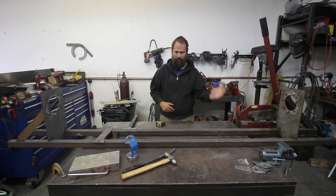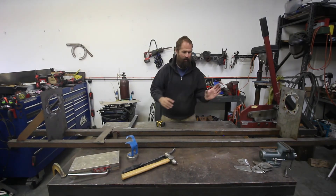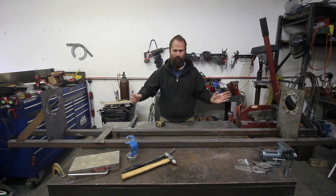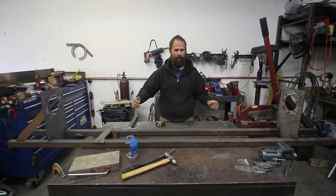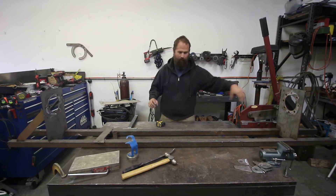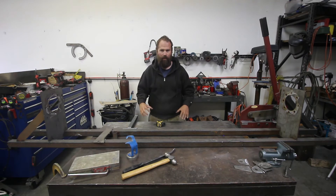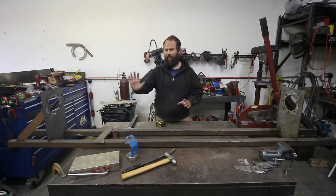I tacked the uniball cup on the front of the fixture so the uniball can sit right on it. I figured out from centerline where this pivot was and I wanted the beam to go straight to clear that diff beam's uniball, then kick it back with as little bend as possible. I ended up tucking this uniball cup as close to the front of the beam as possible — about a quarter inch clearance for the truss and another quarter inch, so about half an inch further forward than the front of the diff. After bending, plating, gusseting, and trussing everything, it all cleared fine. I was able to cut all my plates and do all the tubes on the welding bench instead of under the truck, which was a lot easier.